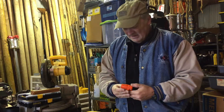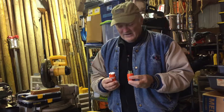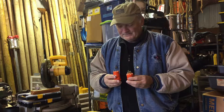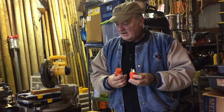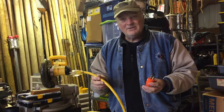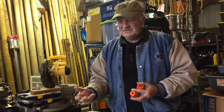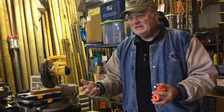So now I've got the job of replacing the parts on this. Because I want this to still be able to plug in to small appliances like an angle grinder or whatever, I still want it to have the 115-volt setup, even though the wire can take a whole lot more. Now, what's the advantage of having this big thick wire? Well, the big thick wire doesn't heat up, and there isn't a big drop of amps or voltage. But I've got like a 150-foot-long extension cord that's got tiny wires — I doubt they're even 14 gauge, maybe 16 gauge — and as long as there's not a whole lot of amp draw to it, it does just fine.